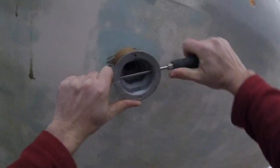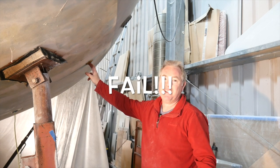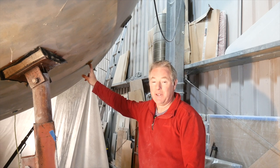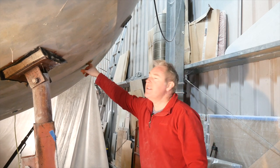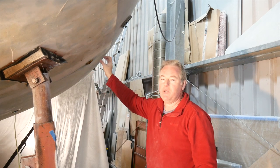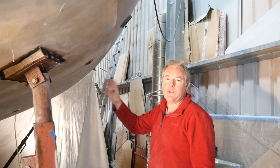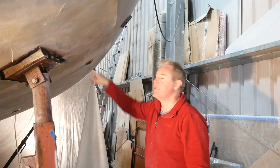That's a bit tight... it has stuck in. I didn't put enough release agent on it. Unfortunately my first attempt at putting a seacock in following that tutorial hasn't gone so well. What I've managed to do is fix my through-hole into that backing seacock flange, because somehow when I bedded down that backing plate, some thickened epoxy found its way into the connection between the through-hole and the seacock, and despite all that wax sealant I sprayed in there, it wasn't quite enough.